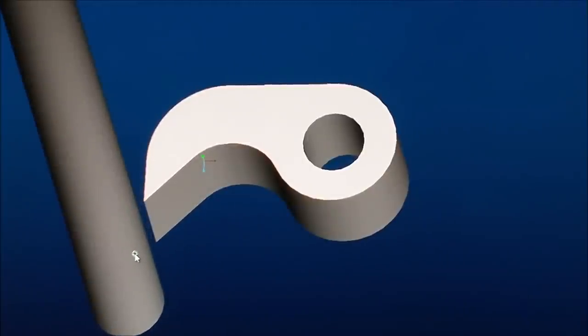Now, a subroutine is just like a stamp with your signature on it that you can just walk around stamping things, and all of a sudden you have an entire signature there, as opposed to actually taking the time to write your signature. If that makes any sense, instead of rewriting a dozen lines of code, this is just one line of code that says repeat those 12 lines. That's basically what a subroutine is.